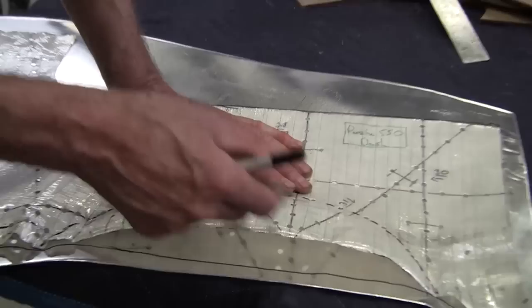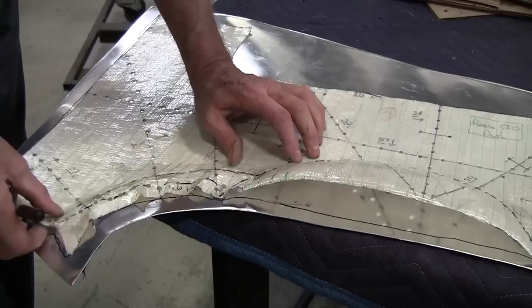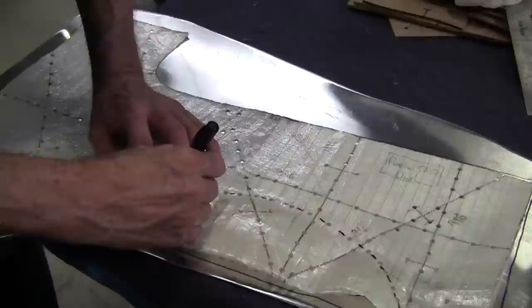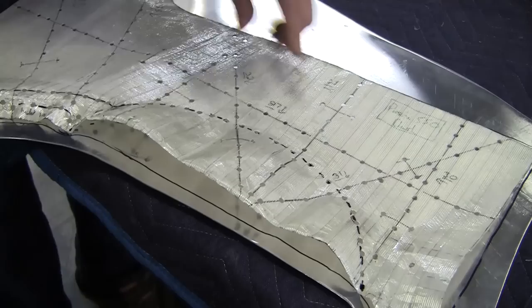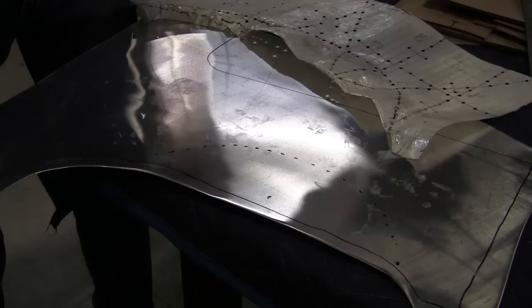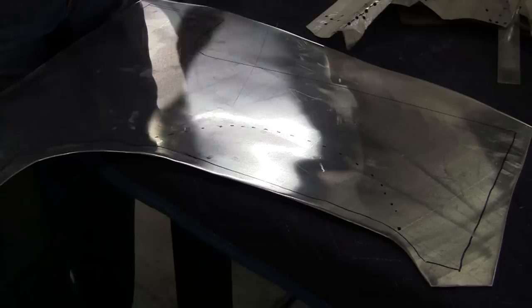We'll get the beater bag over in position. I put the flexible shape pattern on here and this gives me the exact location of where I need to strike. I mark the valley where it starts to make the transition into the hill. I want to thank everybody for the continued support — even though we haven't been doing videos, we've been getting a lot of new subscribers. Please remember to subscribe if you're new. Hopefully we can remedy the lack of videos now that temperatures have gotten a little better.